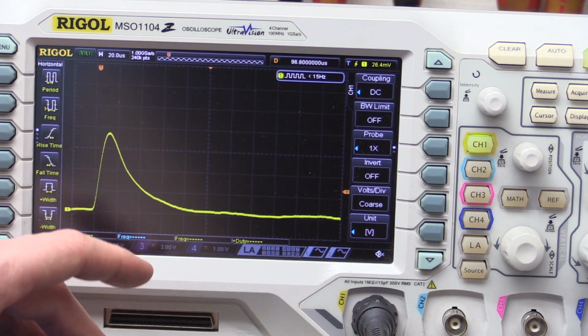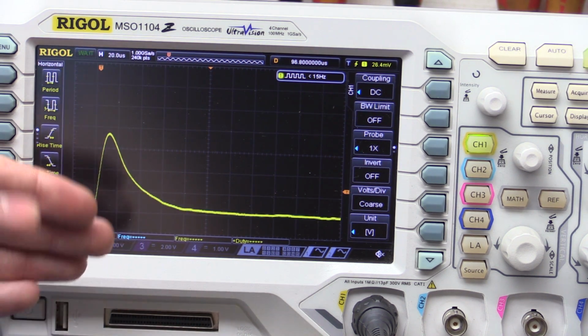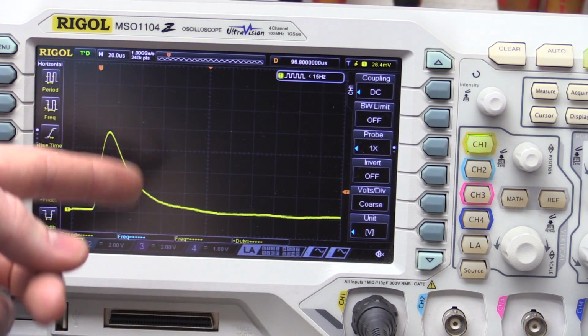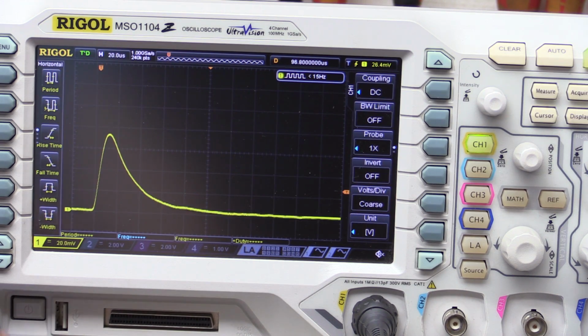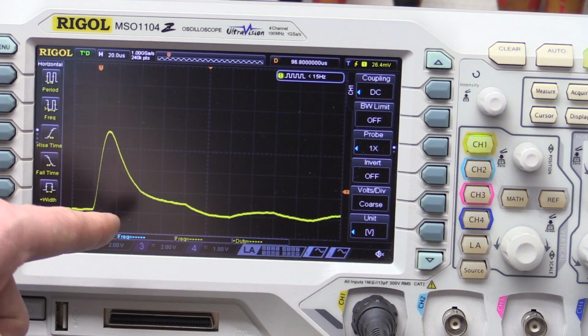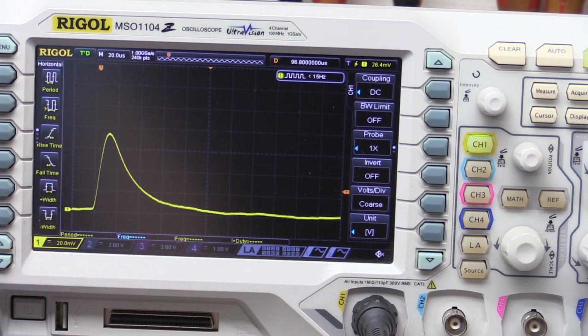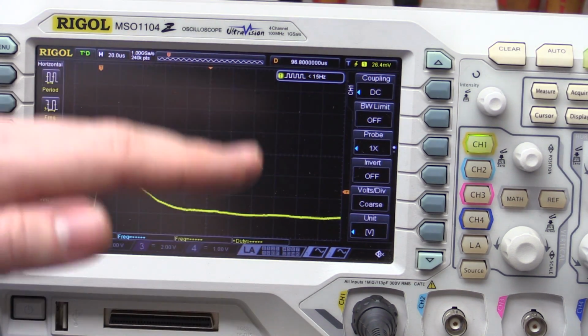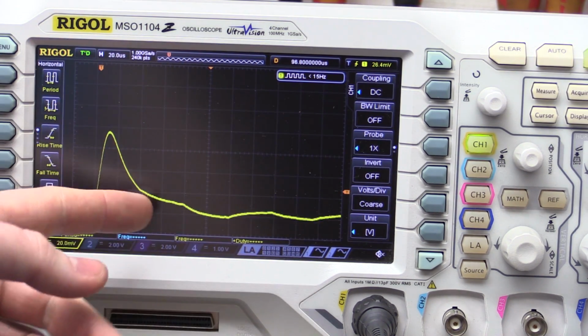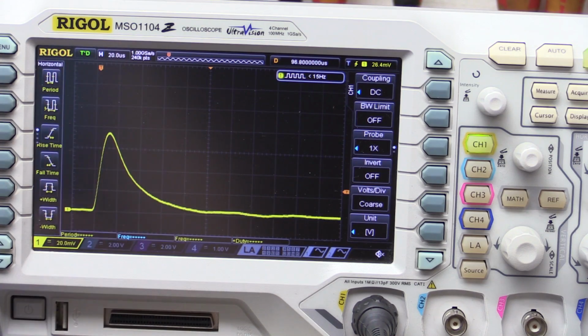So as I mentioned before, I think they are using pulse frequency modulation to basically just make a tiny little impulse of current into the inductor and out to the output capacitor to maintain a reasonable output voltage. As you saw, it varies a lot, but they do this to save power.